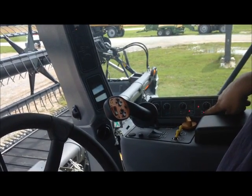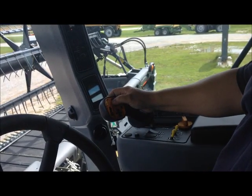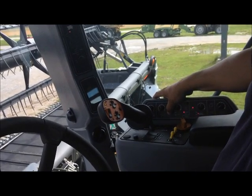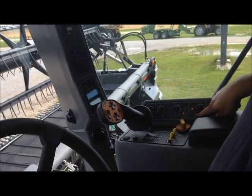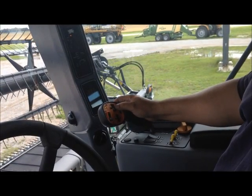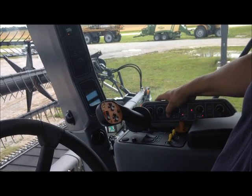It will move our blinking light to tilt the header to the fully left position. After we're there, press Cal 2. Our light will then tell us to tilt the header to the right position. After we're fully right, press Cal 2.